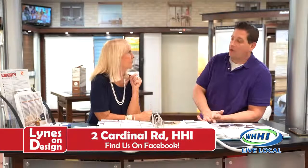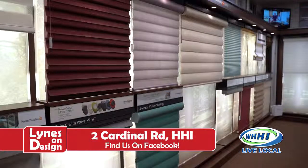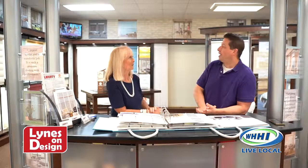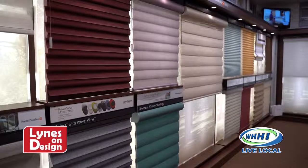What kind of commands can you do with Alexa? Really anything you want. You can have a different setting — once you set up a scene in the PowerView app, the scene could be all up or all down. For example, 'Alexa, turn on all up,' and you'll see she puts all the shades up. As long as you program the scene and name it, just tell Alexa which one to turn on and off. If you want them all half, they go all half. My favorite one is 'Alexa, turn on the neighbors are looking,' and it closes all the shades. We actually helped one client come back out, moved some components, and added a repeater to get the signal working right. There are so many components — not just Hunter Douglas, but different Alexa integrators and home automation systems — and it can be a little tricky getting it all worked together, but it does once you fine-tune it.